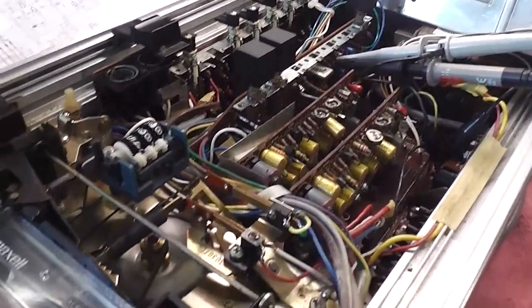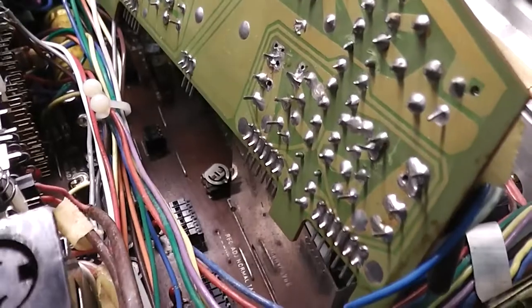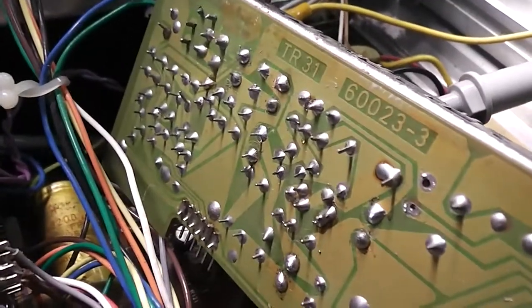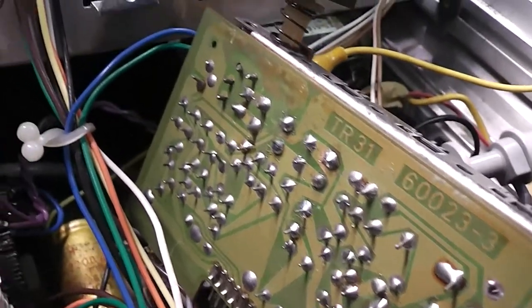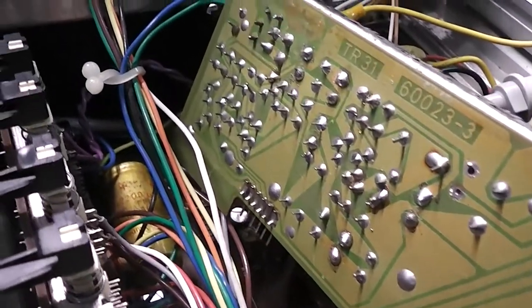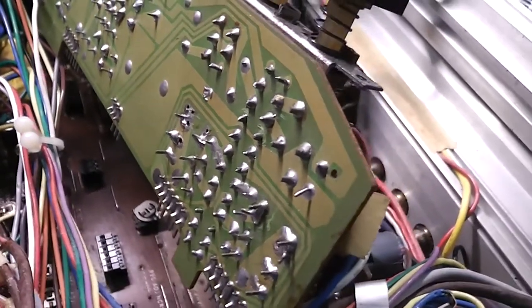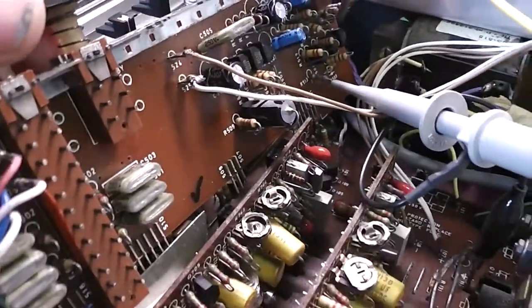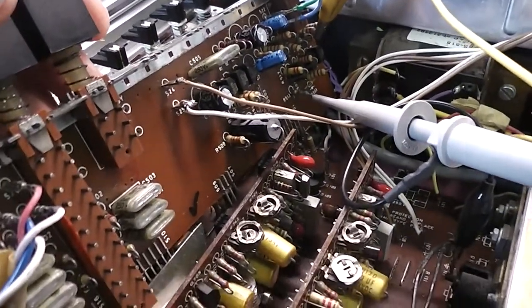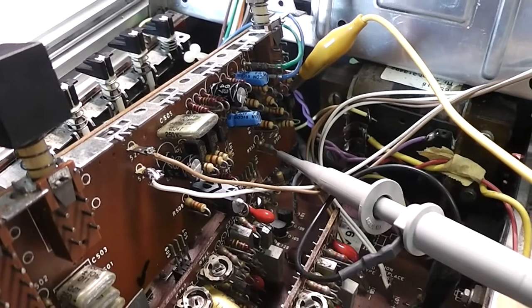With the board back in, random stopping is still occurring unfortunately. Looking at the signal from the amplifier for the spools - it's hardly surprising I've been having difficulty following the circuit for the amplifier 2 board. If I look carefully, this board is actually the board used in the TCD 300, so this must be a very early 310 still using that board. This explains the difficulties following the circuit diagram - always check the obvious first. Since I recapped it, it keeps stopping as though the pulses aren't enough to hold the Schmitt trigger on.